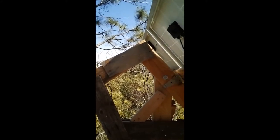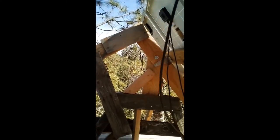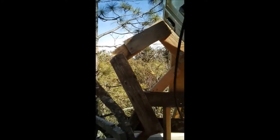In the summer I release that and I could easily put a solar tracker on both axes. Your solar tracker goes right under there by that hinge, and if your panels are well balanced there won't be any stress. Right now I have it set for mid-noon sun.